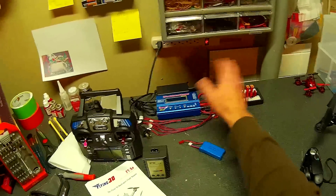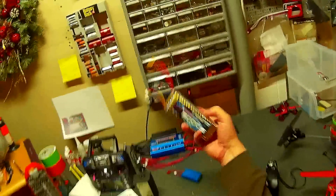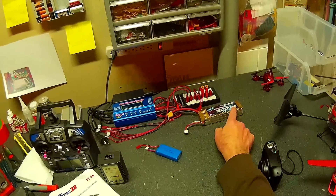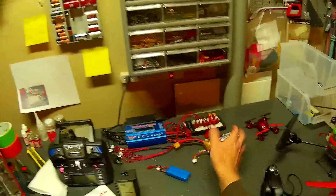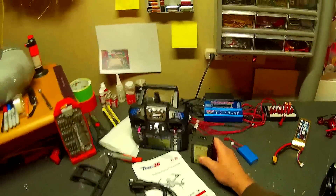I can charge anything from my large battery — this is my 5,000 milliamp 11.1 volt battery for the Cheerson CX20. This charger will handle that because it's 5,000 milliamps, which is five amps, and this is a five amp charger. It'll charge anything from the little JXD 392 battery up to this. Well worth the money — get the balance charger and set the stock one aside.